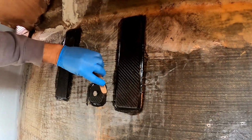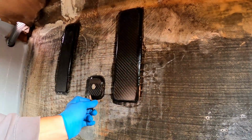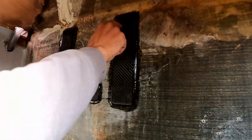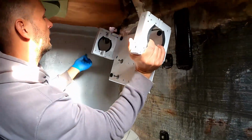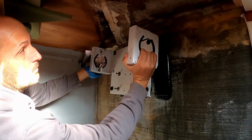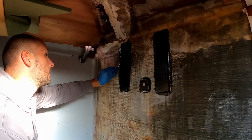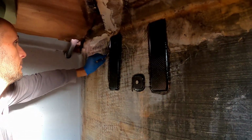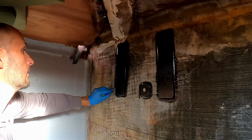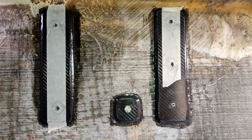Sparbond. So these are what the Watermaker will actually bolt onto. I need to tap and thread. I'll put some thread certs into here, and then the Watermaker bracket will mount there, and then the Watermaker will be bolted to that bulkhead, without putting any holes in the bulkhead. And you're using Sparbond there, yep. Are you going to laminate it in as well? No, the glue area is heaps big enough, because my glue bond area is that wide by that long. You've got all glue on the back. Yeah, it's matte. Okay, so got my mounts for the Watermaker bracket.